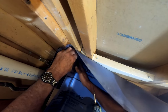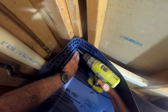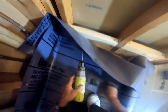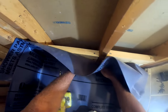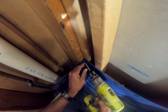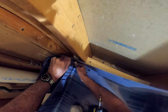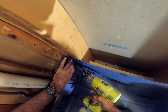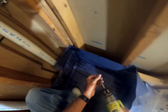Where there's nothing solid to drill into, that's why I put that two-by-six scabbing in — I want something solid for the pan to rest up against and something solid for my liner to fasten into. Some guys prefer nails — roofing nails or drywall-type nails. I've seen others use staples, but given the option of screws or nails, I'm not sure why you'd use staples. You're trying to get that fold in as tight as possible so it's pulling on the pan liner for a nice even surface across all sides. In theory, stud-to-stud fasteners are all you need.